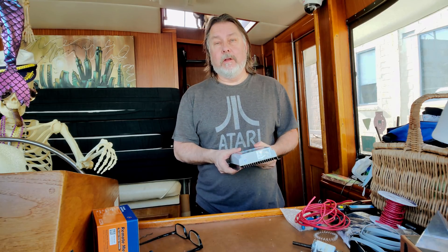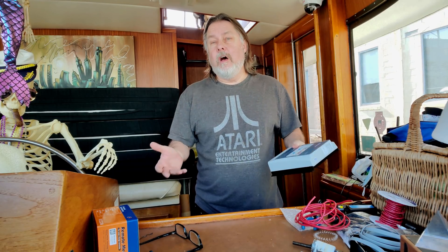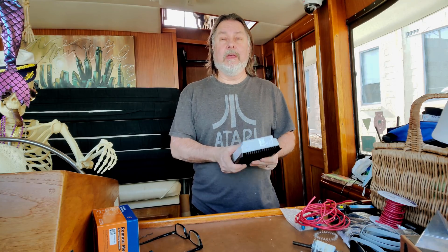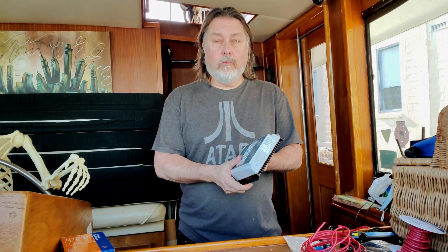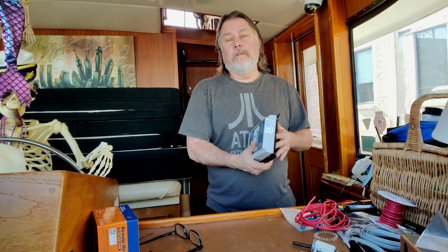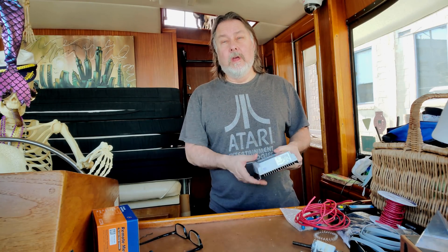This unit is set at 20 amps, so it'll never draw more than 20 amps from my alternator. My alternators are 60-amp alternators, so I figured 20 amps is a good amount they could run at continuously without being hurt. I could have opted for a 30 or 40 amp solar charger like the Victron I installed for the solar panels, but it's a compromise between how much I want to stress my alternator and how quickly I want to charge the batteries. We typically cruise about five to six hours a day, so five to six hours charging at 20 amps should do a pretty good job.